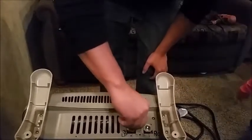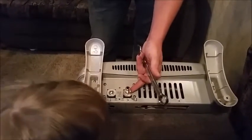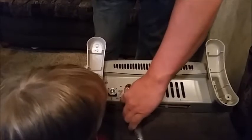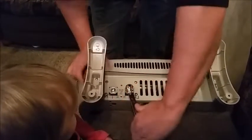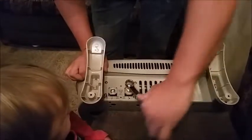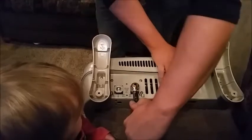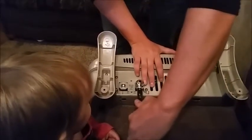I like to start it by hand. Now that we've got this here, we've tightened it by hand, and now we're gonna take an 11-sixteenths wrench and go ahead and turn it down. I just want to tell you, if you're doing this yourself, it's very very important that you use that yellow Teflon tape. If you don't use that yellow Teflon tape, you're gonna be leaking propane back in your house, and that can be a serious problem.